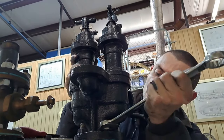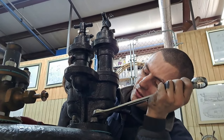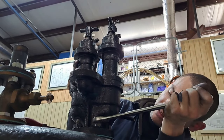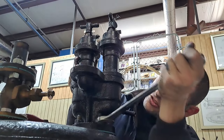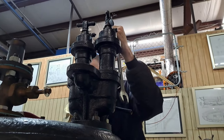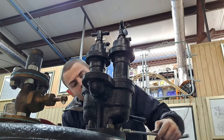I would prefer the really heavy, real machine nuts, like in the steam days, instead of being rolled threads like these crappy modern nuts are, they were properly cut threads with a tap or sometimes even an internal single point thread cutter, and of course the crown of the nut was crowned and the bottom of the nut was flat with a machine surface on that end, so you really had good engagement. These modern nuts are nothing like that, and sometimes you get a grade 8 nut and they're not like that even, so we need to probably make some if we really want proper nuts and bolts on everything. But this needs to be properly done. All these horrible blanking plates and everything need to go. I want proper flanged fittings on everything and a full suite of turret valves and everything else you can think of. A whole smorgasbord. I don't like these.